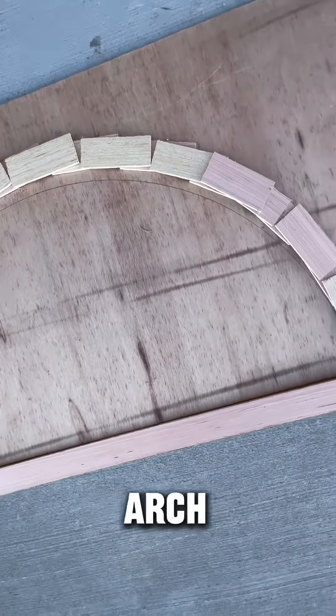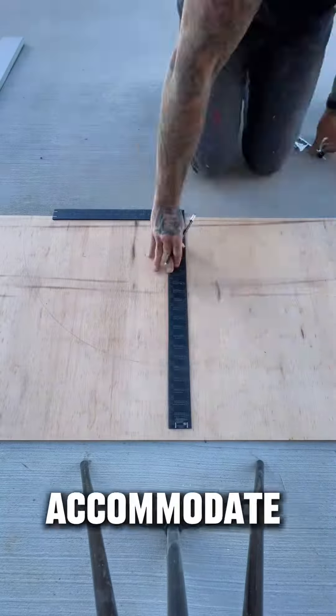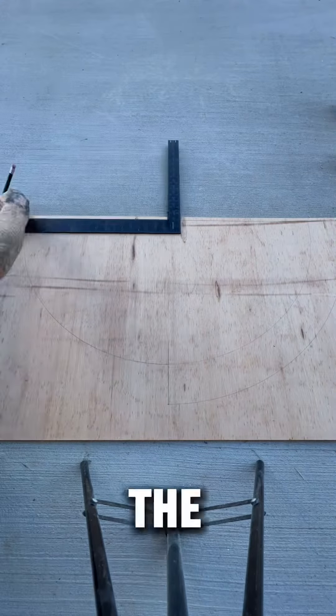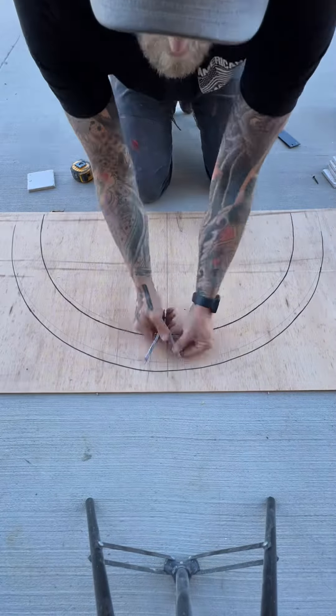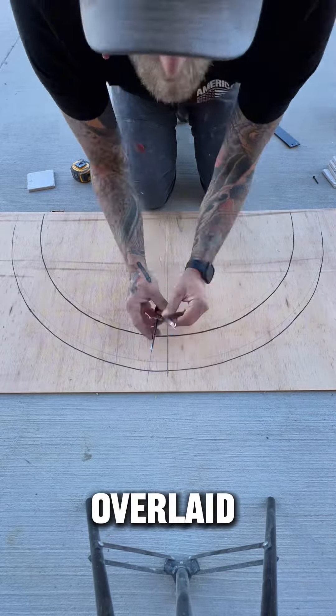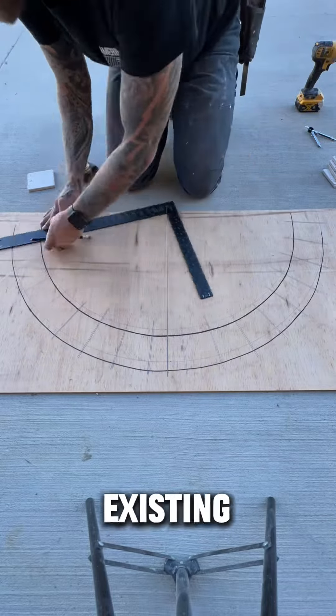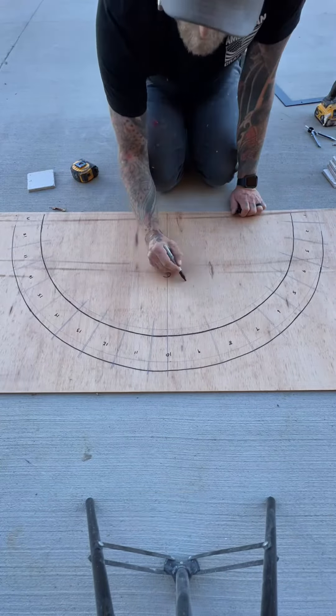See, the original arch is the pencil line. Now using a 10% reduction in size of the tile to accommodate for a radius cut, I'll lay out the extrados of the arch. Now with the perfect arch drawn and the true arch laid out overlaid, I'll lay out my voussoirs to the perfect arch and then transfer those lines through the existing arch, which will give us our angles.